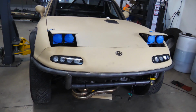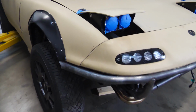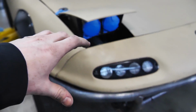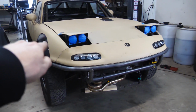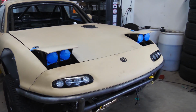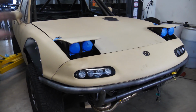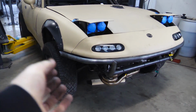And after cutting into my $400 headlights, they fit mostly. This is as low as they can go. The light itself is actually resting on the bar, so it can't go any lower. I'm gonna build the mounts in a way that I can adjust the height of the entire housing with essentially a threaded rod. That way I can leave it as is for now, and if the visibility sucks, or if I want to lower or raise the housings, then I can adjust that rod.